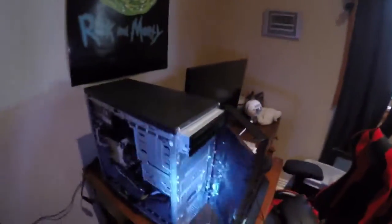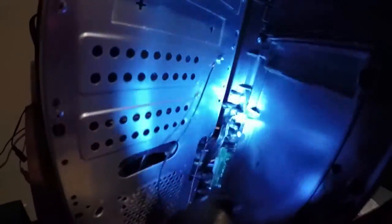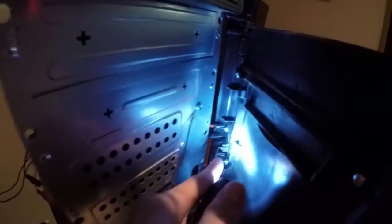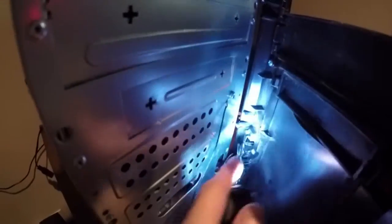Today I'm going to teach you how to turn on and off your computer with Alexa. Essentially there are two wires going to your power button, and when your computer calls for power, the switch connects these two wires together, which sends a signal to the motherboard to turn on. You need to trace the two wires coming from your power button — I pulled off the front cover and they connect right to my motherboard.